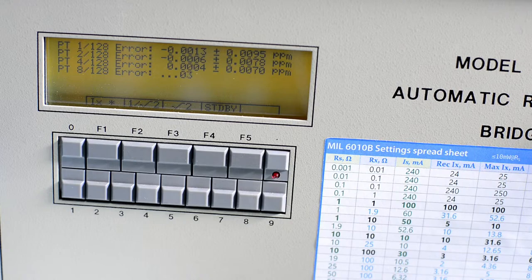But the concept is the same, and it's also capable of doing the comparison on resistors within less than ppm of uncertainty. And 6020 is a bridge they modified and particularly improved for quantum Hall effect comparisons. So that 6020Q is the part of the 6800C or the previous older quantum Hall effect systems that are essentially able to have the absolute unit of ohm from the quantum Hall standard compared to normals like wire wound resistance standards.